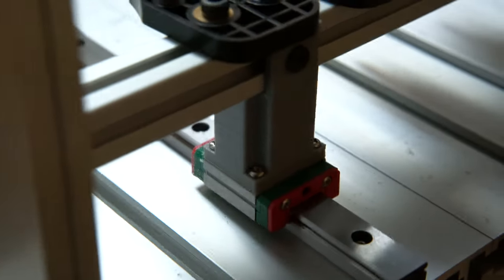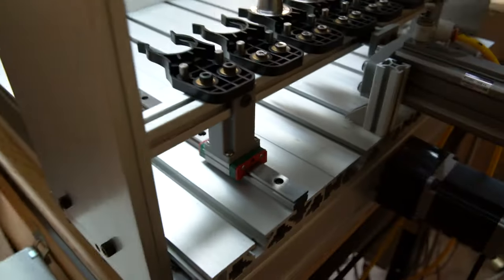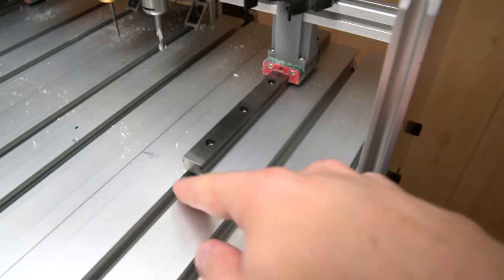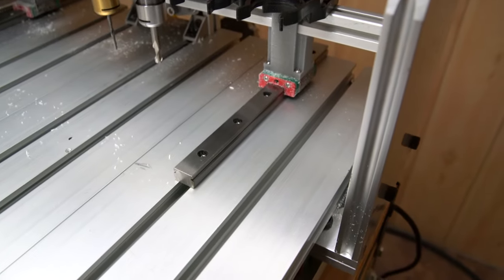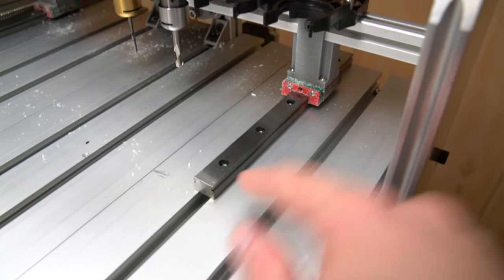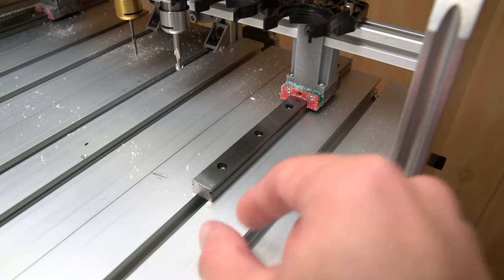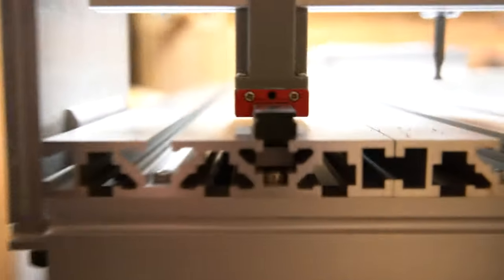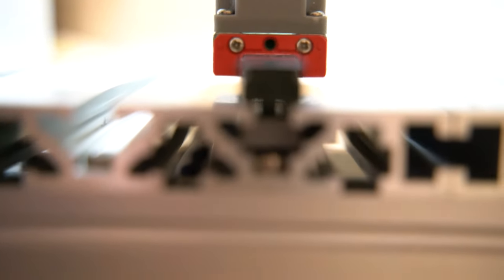Here's the design for the columns. And I actually had to 3D print a large sort of T-slot rail that goes underneath these rails, and I had to basically install M3 threaded inserts with a soldering iron, basically like melt them into the plastic piece. Let me see if I could give you a shot on what they look like. Yeah, so here you go. You can kind of see it. Oh, nope, not really.